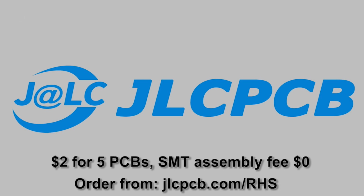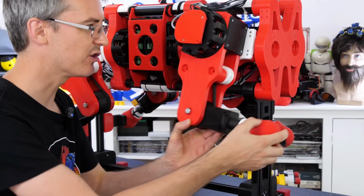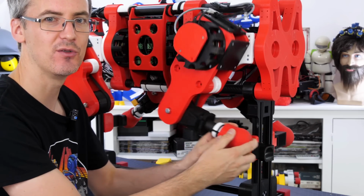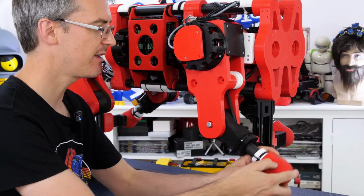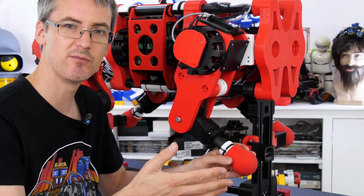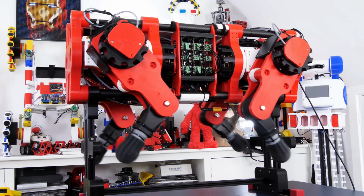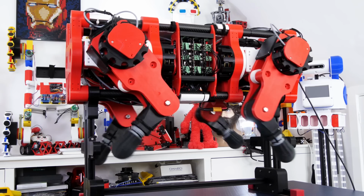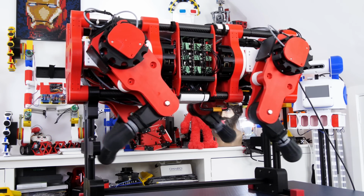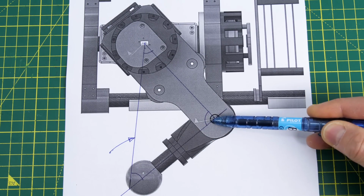So your typical robot dog has 3 joints. It moves this way on its hip, it's got a shoulder and it's got a knee. And with those 3 joints I can pretty much move that leg into any position I want to, and those joints are doing nothing like 180 degrees, they're probably not even moving 90 degrees. And then we use a system of inverse kinematics, which means that I can position the foot in any position I want to in XYZ Cartesian coordinates, essentially. And I can put that anywhere, and then we use maths using inverse trigonometry to work back all of the joint angles so that we can position those joints in the right position to achieve that position on the foot.